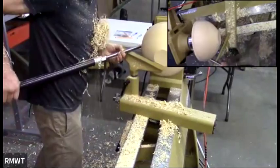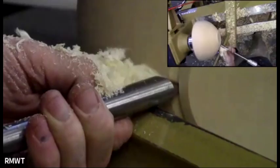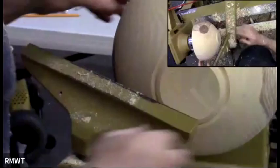And I'm making this an enclosed bowl. And then we'll put a tenon on here. So I can use the same gouge for the tenon because its included angle is 40 and 40, which is 80, which means I can grip it on this tenon right now. Just as a tool, I got a little bit of a blip there, but I'll leave it in. I'm not going to take that out. That would stand out. Normally I don't intend to get that, but I didn't realize I've got a little blip. Ooh.